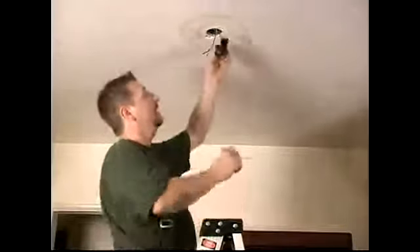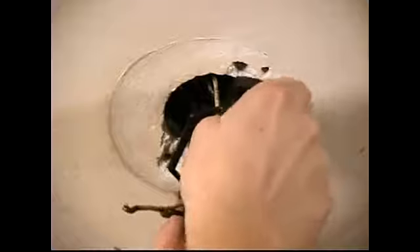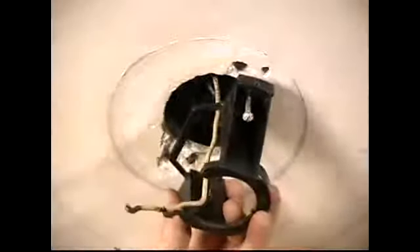What we're going to do is mount this bracket on the ceiling into the existing two holes that you had there from when you took the other one down. Just make sure you slide the bracket right through the wire and put your screw right back in that hole. Be careful not to cross-thread this because it'll strip it out and you'll have to replace the box, and you definitely don't want to do that because you'll have to call me out and I cost a lot of money.